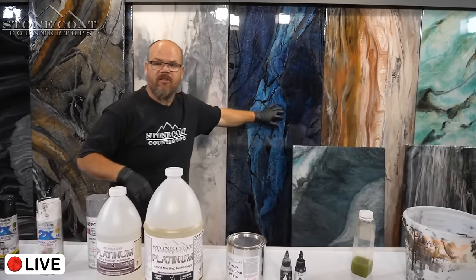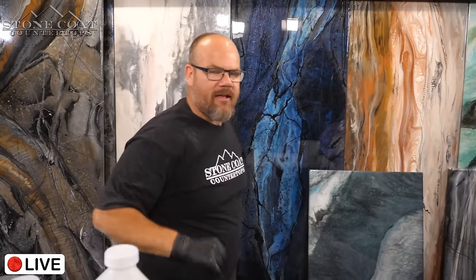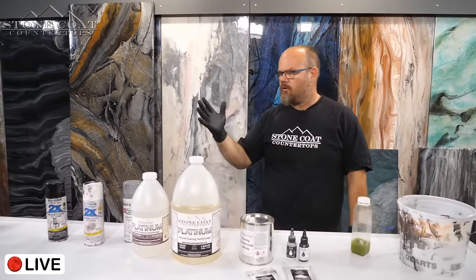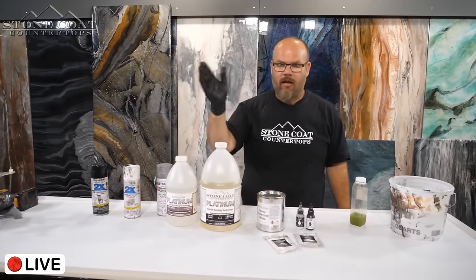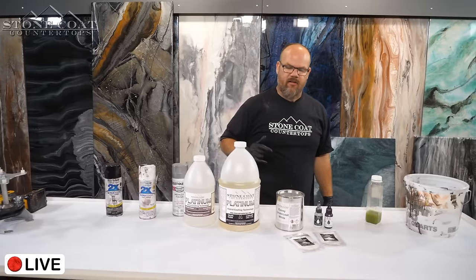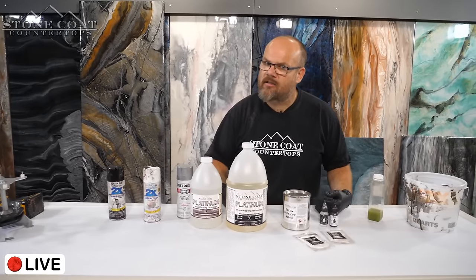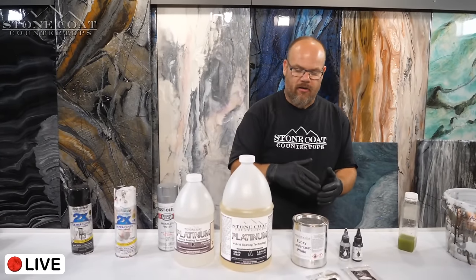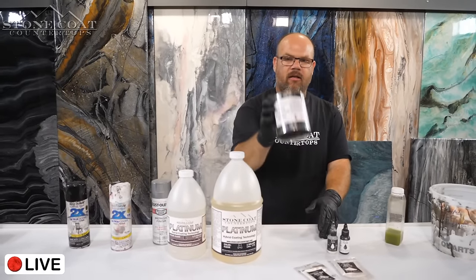These are samples. When I get better and evolve my techniques, I look at some of my samples from 3 years ago, I'm like, bro, you can improve. And so I grab those old ones because we get asked all the time, can I go over my old epoxy? Can I refinish it? Absolutely. Sand it. You need that mechanical bond between the old epoxy and the undercoat.